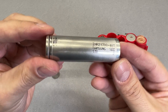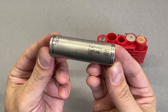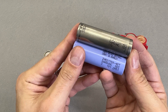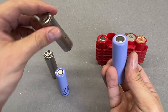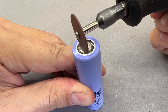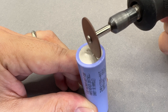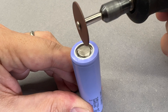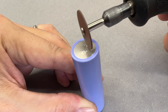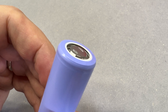Bosch packs Procore batteries with Samsung INR21700 40T cells, so I bought a replacement pair of the same model. There are two minor differences: the new one has an insulating wrap, and it is reclaimed from some previous battery pack, so some spot weld leftovers are exposed and we need to address that with a rotary tool. Reclaimed cells from a trusted seller means you are getting cells that aren't used — they have zero cycles on them, but due to quality control or other issues, the battery pack was disassembled and cells were tested. It's a great option to get unused cells with a nice discount.